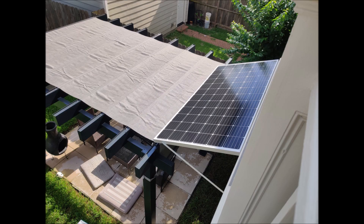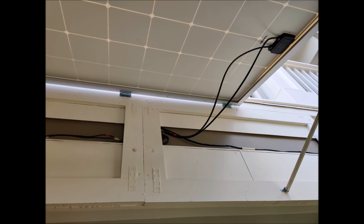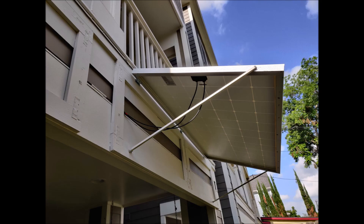These panels are hung on the back of my house facing south, because in the northern hemisphere you want your panels to face south — and in the southern hemisphere you'd face them north. They're mounted on door hinges on a wooden frame screwed into my siding and they swing up and down like a door, held at an angle by prop arms. I'm in Houston, which gets a lot of hurricanes, so I wanted to be able to swing them down and strap them when a storm comes through.